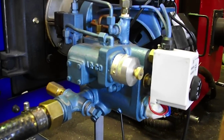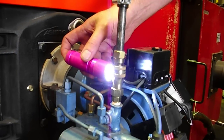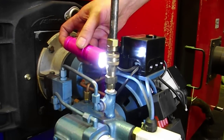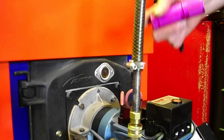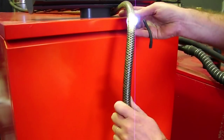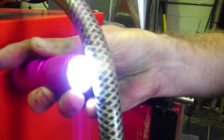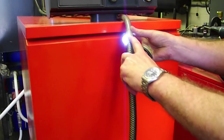The second thing is that with all the Kroll BR burners, they're an open vented gravity feed oil supply system. And what you're looking for is that you've got oil coming through the degassing pipe here. This is a transparent pipe by the way — you can see there's our light and there's the top of our oil supply right there. So that's the oil supply level of our supply system and we've got oil coming out the degassing pipe.